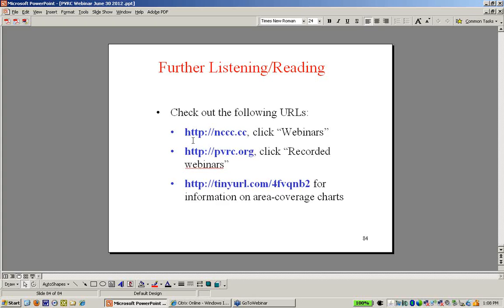In order to achieve one at 2 degrees, which a lot of the very far DX is coming in on, on the lower bands and the upper band as well, you've got to be very, very high, or else on a mountaintop, in order to challenge the Foursquare on 80 meters. Certainly 160 meters is even more challenging in terms of the height necessary to achieve a low elevation angle from a horizontally polarized antenna. Okay, a couple questions here and then we'll wrap it up.